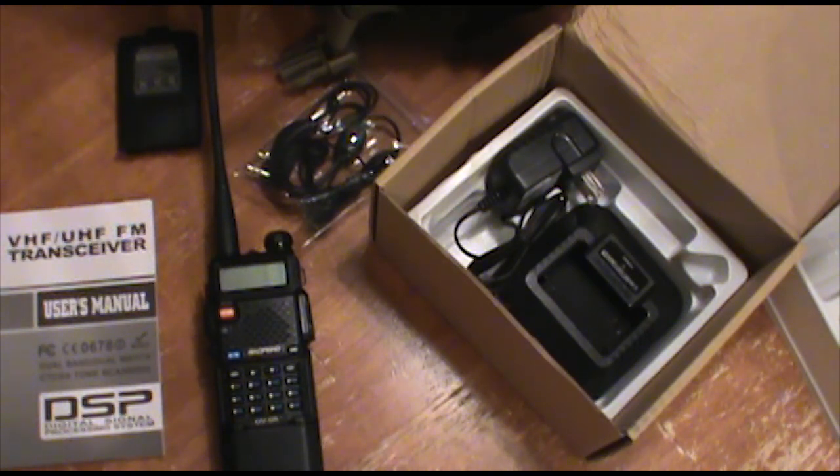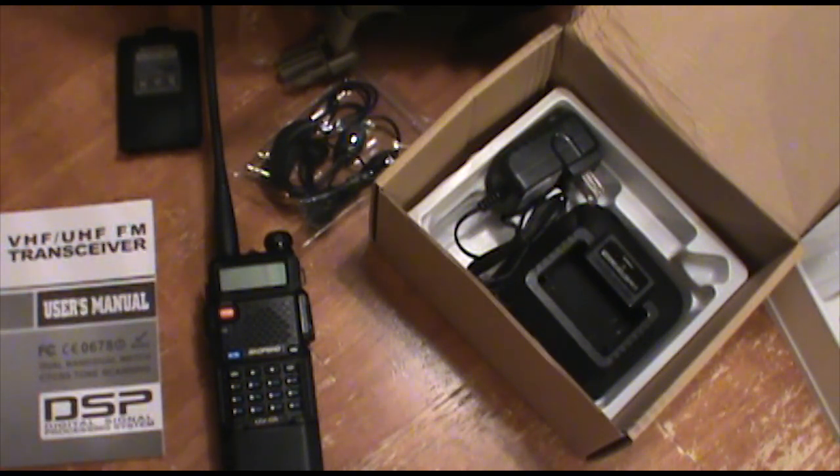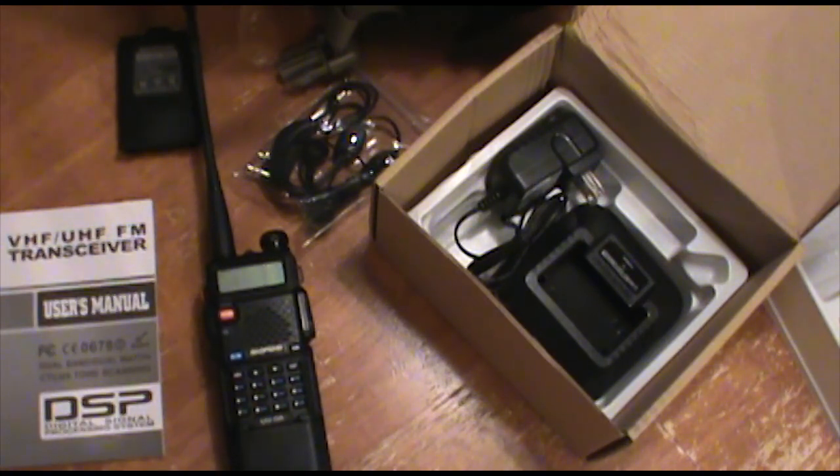It is much easier to use some free software that exists on the web — I can't remember the name, but I think it was something like Chirp. All I did was search on YouTube for Baofeng UV5R programming, and in one of the first few videos the guy shows the free software. You also have to buy a cable for $7.95, which gives you the ability to hook this to your computer. You install the driver for the cable, download the software, pick your radio model, and program it in more of a spreadsheet — rows and columns. You can set options like receive-only or receive and transmit. You can customize law enforcement channels to receive-only so you don't accidentally key up on a law enforcement channel.